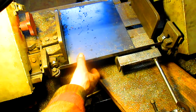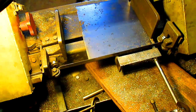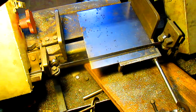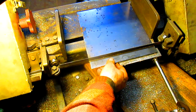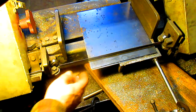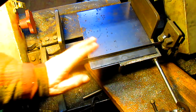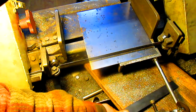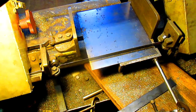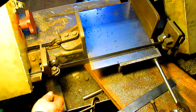So let's bring our sheet metal in. And I'm going to give myself a little bit more room. I'm going to have about 1/8 of an inch, because we're going to sandwich all these together and mill them as a unit. So, you know, 1/8 of an inch amongst friends, no big deal. All right.